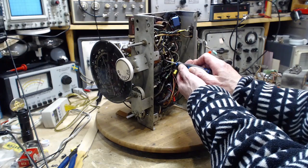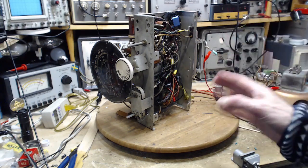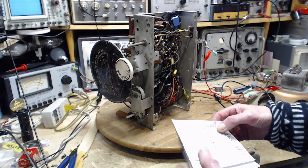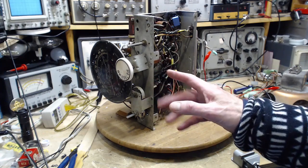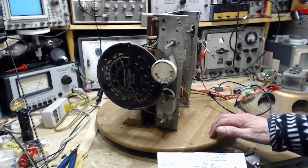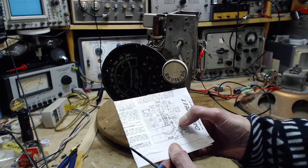Like that. Did the signal get quieter and quieter? Could be well aligned at the wrong spot. And now I'm moving it to the right spot. Is there another adjustment? There is, isn't there? Carefully tune and adjust trimmer number 12 to a peak. Now we do that. Oh, wait a minute. I almost made a mistake there. We just adjusted 11, the trimmer, so we've adjusted the local oscillator. Carefully tune the receiver to the signal. Adjust the trimmer number 12. Oh, 12 is up on top. 12 is the one where my capacitor is connected. 16.